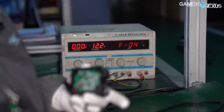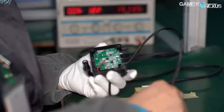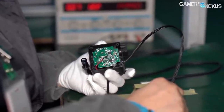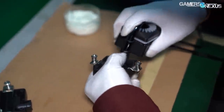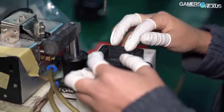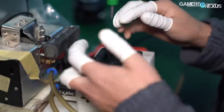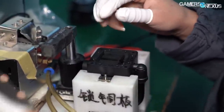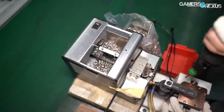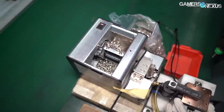So: one, there's no liquid impedance, and two, the operator needs to take into account whether it's a 4-pole, 8-pole, or similar design, and divide by the appropriate value to get the true RPM. Ultimately, they're just looking for a number within an acceptable range to show that the pump works. After this, the next step is to mount the external hose into the bottom chamber of the pump. The final step is to mount the gasket and the cold plate to the pump along with any jet flow plates, and use a robotic arm to hold the cold plate firmly in place while all of the screws get installed. Screws are dispensed from a hopper, the chamber is held upside down by a custom mount, and the screws are installed in a specific pattern to ensure force is distributed evenly during assembly.